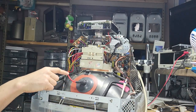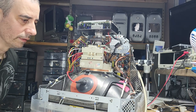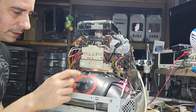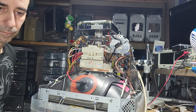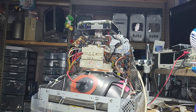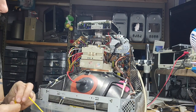Yeah, you can see a brand new cable here. So this is obviously the brand new flyback. And there's a safety precaution. I don't want you guys to just touch this piece here, so you have to be very careful when you work in this area. I'll show you the procedure, as long as you have a rubber handle screwdriver, an alligator clip, and a plastic spudger so you can move that little boot. So we'll do this right now.